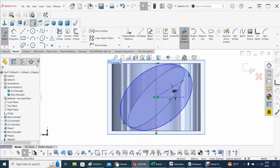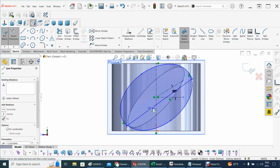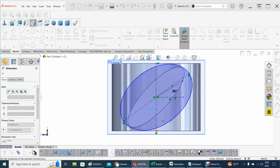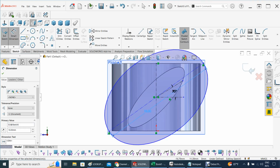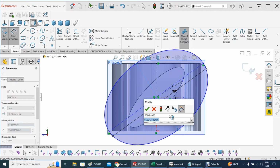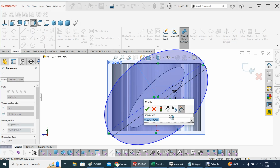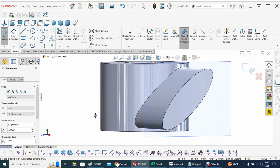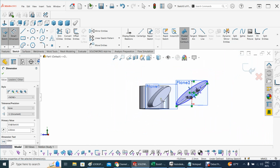So let's say that we go here for, the first one was close to 12, so I'm going to go basically about 18, and I'll fix it later on. But in terms of the thickness, this one, I think this is the other one, yeah, right there, I'm going to keep the same thickness, the 4 millimeters, and that will do. And now the question is, you see how the propeller is right here with the 4 and the angle of attack very high versus the 30.